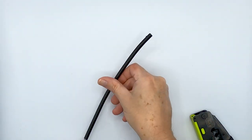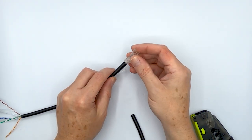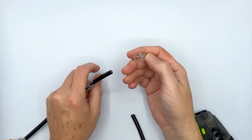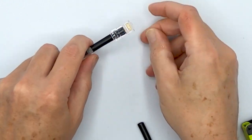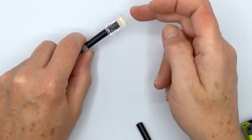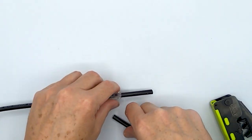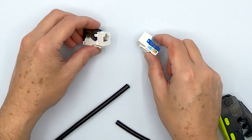When it comes to RJ45 plugs, what you'll use is our large cut-to-fit strain relief boot, and we'll slide that down. That's a good fit, nice firm fit there. And then we have our Category 6/6A pass-through plug, unshielded. It goes right into that plug with very little effort. As you can see, I almost got it all the way up towards the golden contact. So it's a really good fit for that cable, and the insulated conductors are an excellent fit for this plug too. Then just simply take your locking boot here and push it up so it's even, then terminate it and you're done.